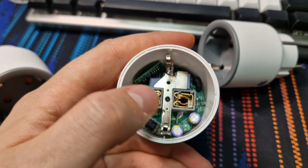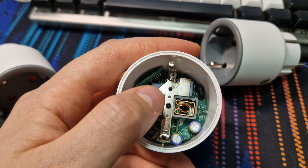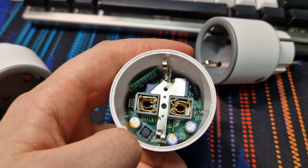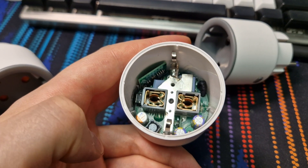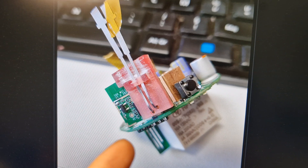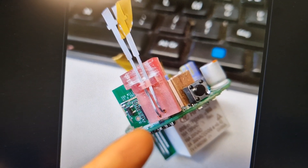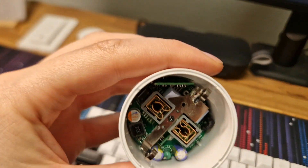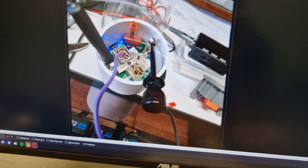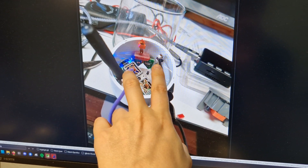Once you have that off, you can take out these blue thermal pads, and under those there are the two solder points for live and neutral, so you have to undo those two. This desoldering is what makes it really annoying — everyone else in that thread thought so too. WinWin made a resin-printed jig, but from what I can read in the discussion it is not foolproof either. The way it seems to work is you slide it down the side and keep trying until you hit the RX and TX legs, then power it with five volts through those two connections.